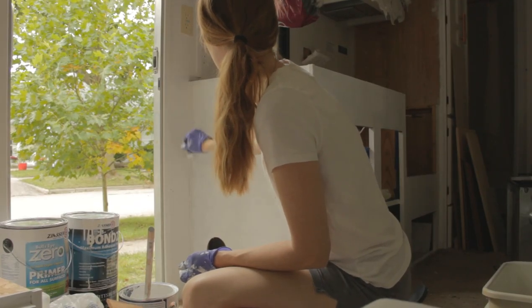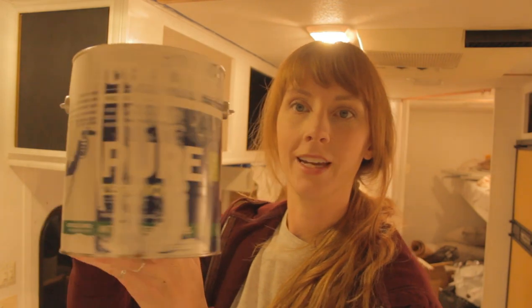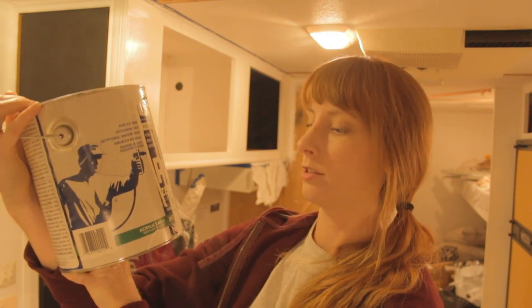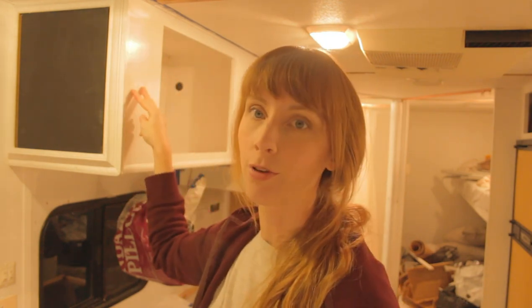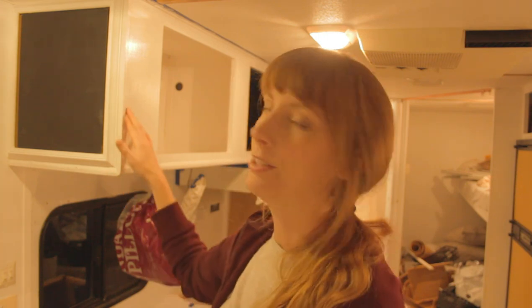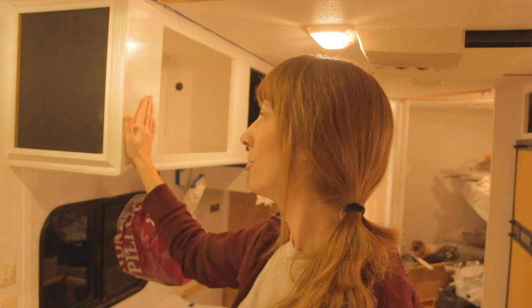It's the next day in the afternoon and I'm doing another coat of paint. Today I painted another coat of semi-gloss paint onto the cabinets. The paint is called Concord Pro Pure Zero VOC interior semi-gloss — I used satin on the walls and semi-gloss on the cabinets. That makes five coats total: two coats of primer and three coats of semi-gloss. I'll probably do a little touching up on the trim, so maybe six coats total on some parts, but pretty happy with five.